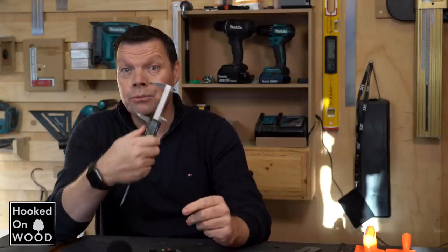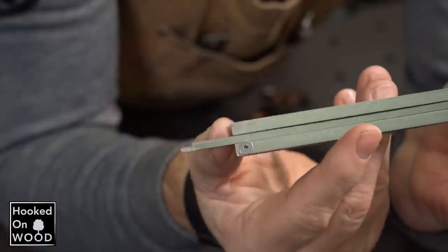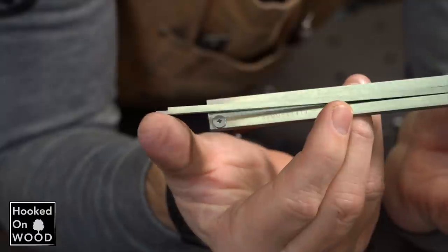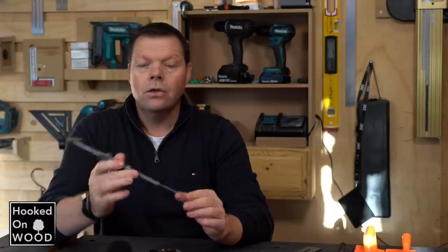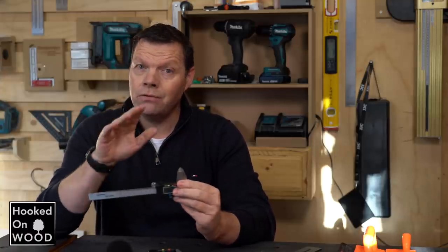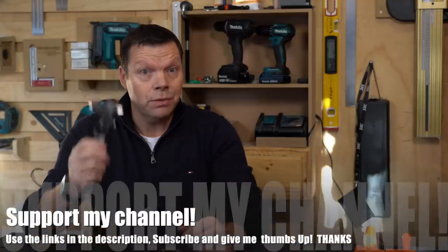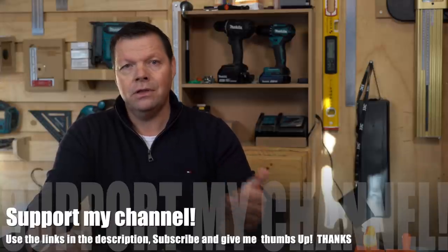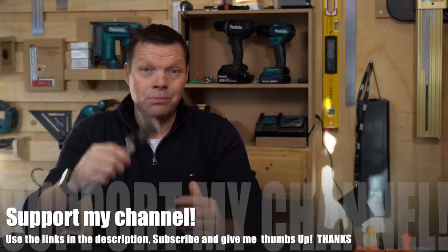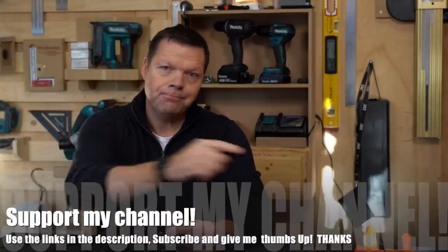So I think this one performs pretty good for just $12. The only drawback was the security of this pin - the screw does not manage to keep the pin secured in its place. To summarize this caliper: I think you get a very good caliper for its price. It was really accurate in my test, more accurate than I thought would be possible within this price range. My $60 caliper performs a little bit better on fit and finish and comfort to work with, but this caliper's performance is excellent for its price. And this is my scoring card.